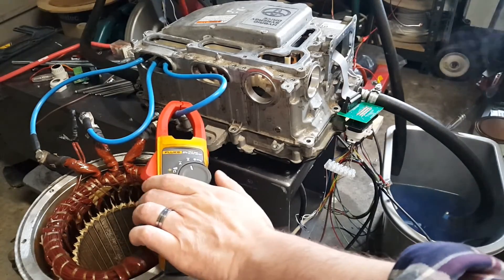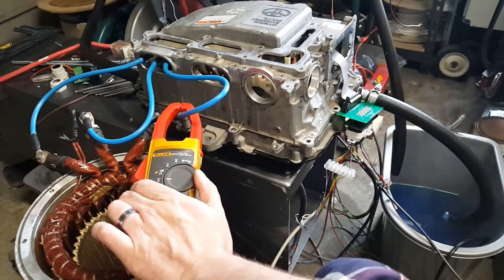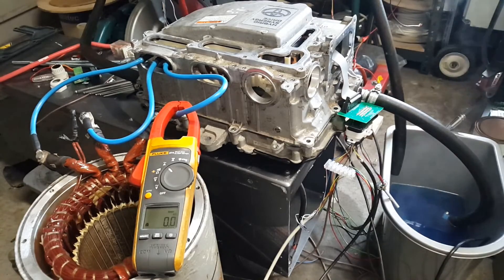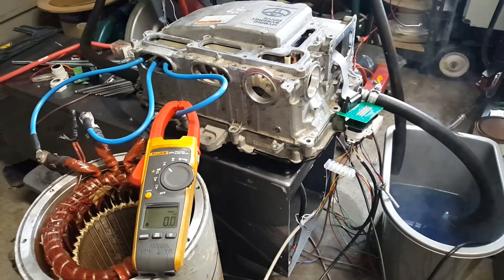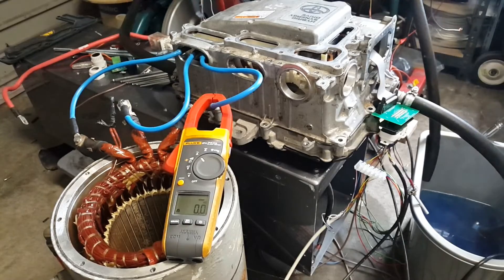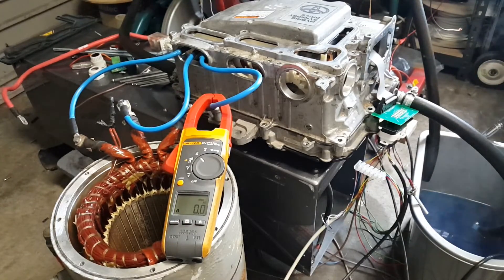And of course the multimeter had to stop as well. I don't think there's anything else gone — just disconnected the high voltage. It was in fact the pump burnt out and killed the 12-volt feed. So let's just prove that to you. We got the 12 volts back up. I'm going to need a new eBay pump. Can I get reconnected here to the inverter? Yeah, that was not the failure mechanism I was expecting. But this is the thing about testing — you never quite get the failure mechanism you were expecting.